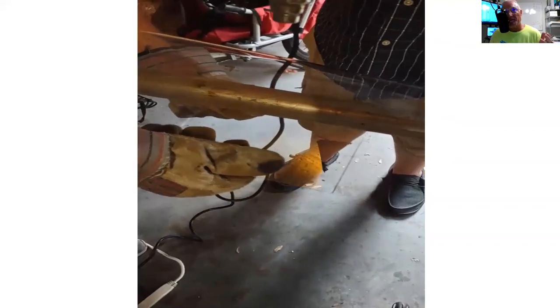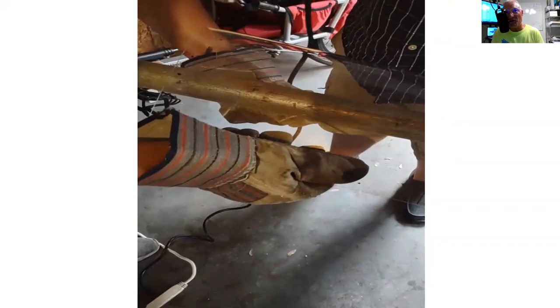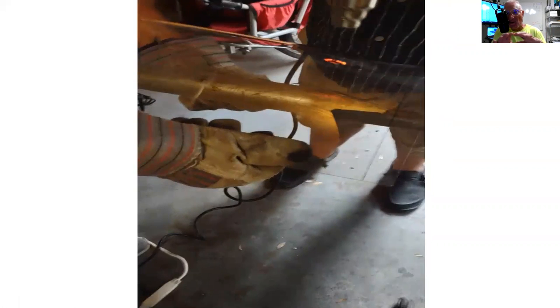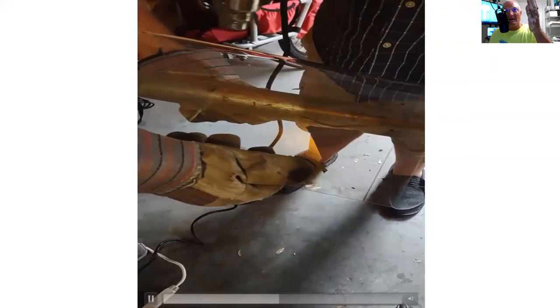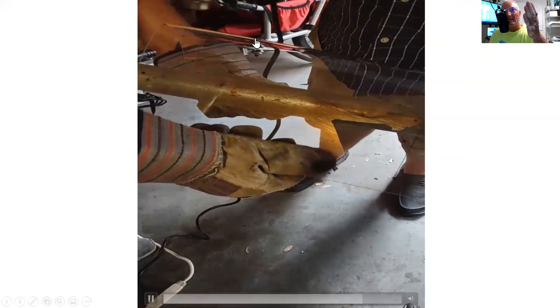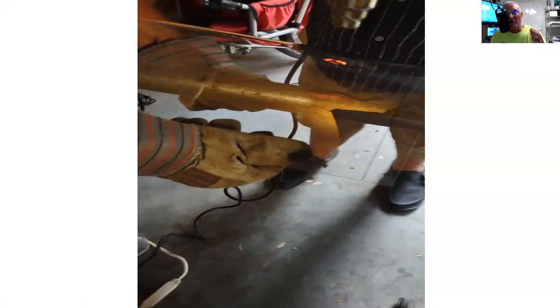And when it's bending, you can't bend it to a point. You've got to bend it so it's round. It has to be round, not to a point, because if you just try heating it in one spot and then bend it, you'll end up with this. You've got to end up with this. It's got to be round. So once again, we're talking probably 350, 400 degrees, and the pipe underneath was allowing additional heat to rise up and keep it heating as the bending was happening. And make sure you don't touch the heat gun to the polycarbonate, otherwise you scar it.